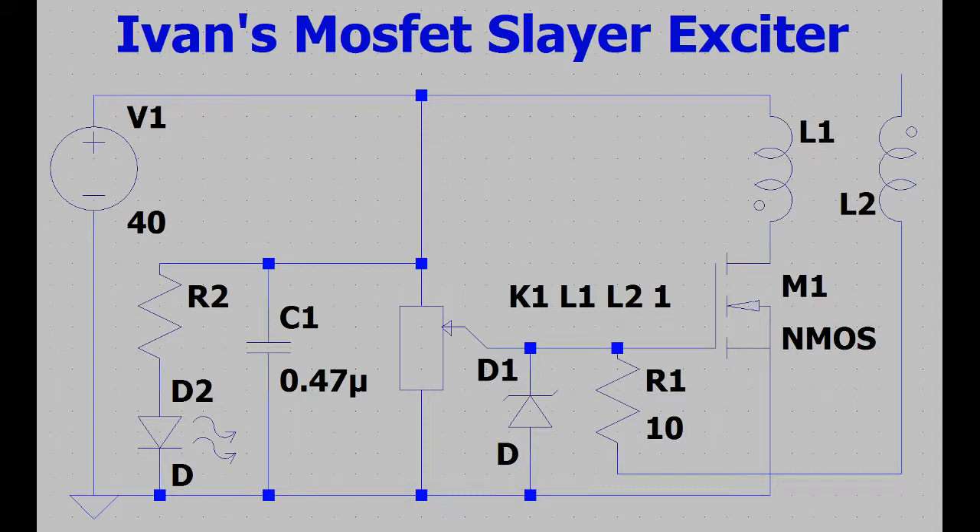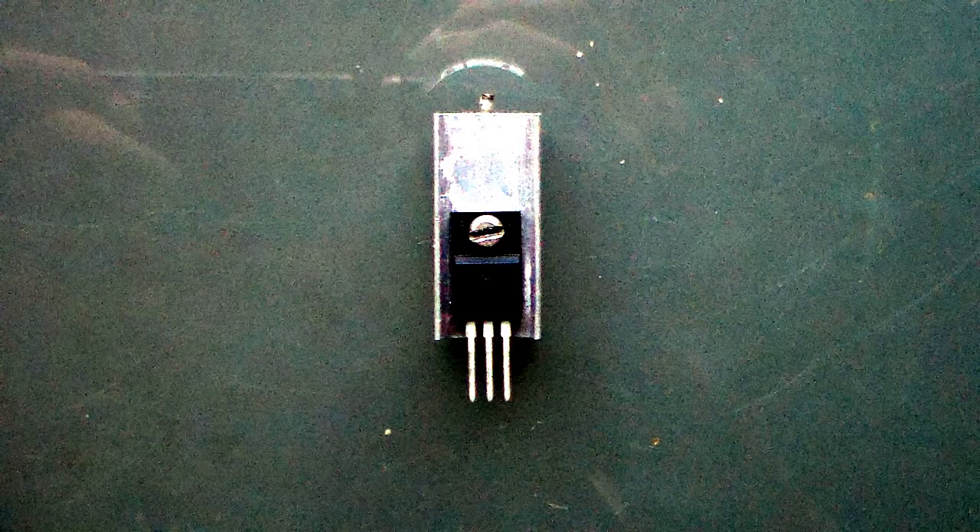However, this can create problems such as unnecessary heating or unnecessary power dissipation which may damage the transistor. The MOSFET I'm using is the N-channel NDF04N60ZG MOSFET. It is rated at a breakdown voltage of 600V, a maximum switching continuous current of 5A, and a maximum power dissipation across the device of 30W.